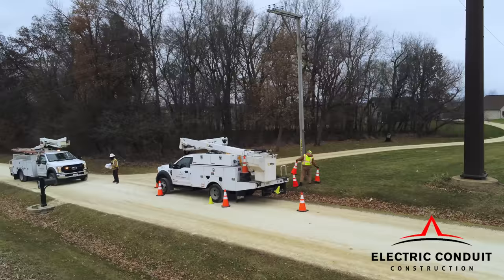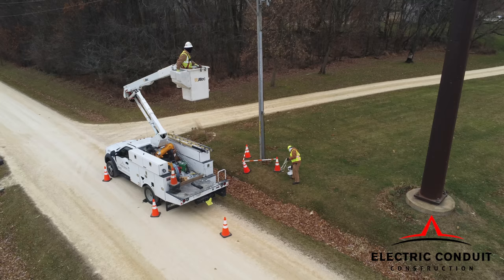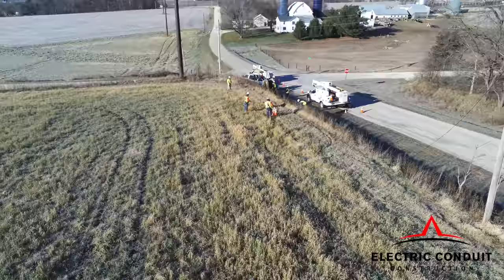The typical fiber crew, whether ADSS or overlash, will vary depending on the task to be performed during that stage of the operation. For example, a crew makeup while framing out poles or overlashing will typically consist of a two-person crew. A crew installing the actual fiber can consist of 6 to 12 personnel depending on the length and the size of the fiber cable to be installed.